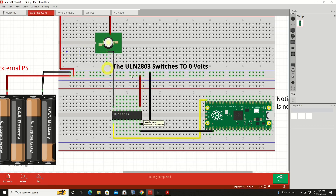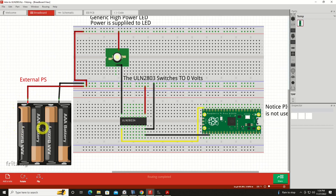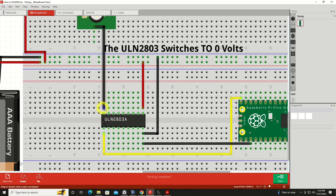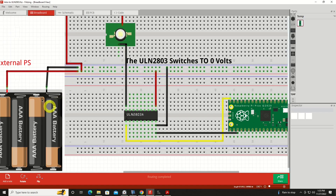Looking at the wiring, at GP15 I've got a wire going to the number one input of the ULN2803, and a ground wire going to the same ground connection on the ULN2803, which comes back up onto the ground plane and back to the power supply. All the power flowing through the circuit goes this way and not back into the Pico. This is our logic side — the Pico and these two wires and the first eight pins of the ULN2803 chip. Everything else is on the power side. Six volts comes in from the power supply to the LED on the positive input side.